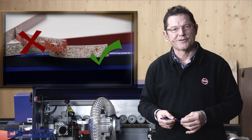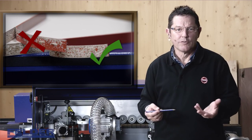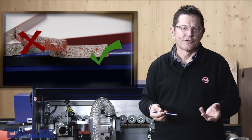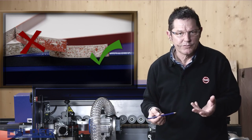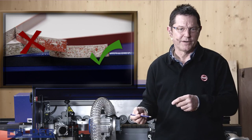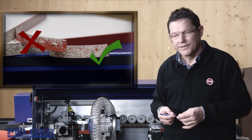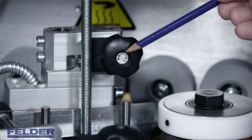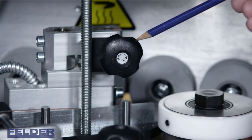This is a perfect result: the glue is applied equally over the full height. If the bonding is inappropriate or the aggregates and workpiece become smudged with glue, the amount of applied glue is either too low or too much. You would have to adjust the glue quantity with this knob — turn it fully into the minus position and then open about two turns into plus.